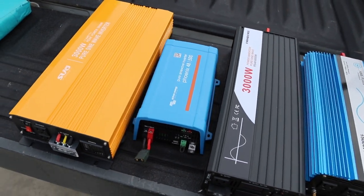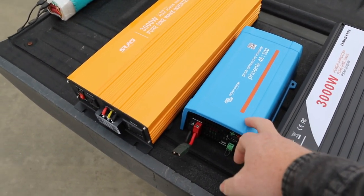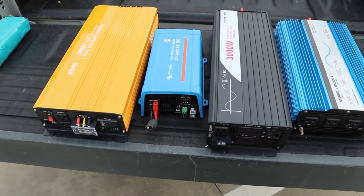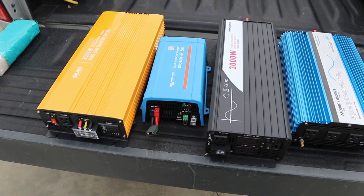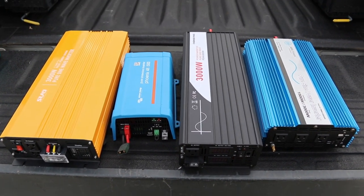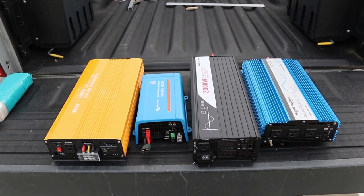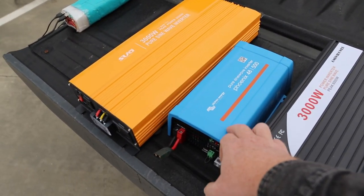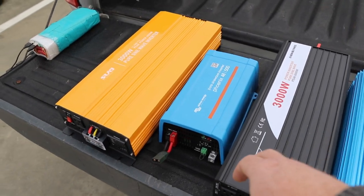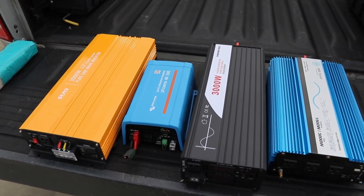About a year ago I bought this Phoenix from Victron Energy, and that's the company and inverters that I like. I'm pretty sure this is what they call a low frequency inverter, and the rest of them are high frequency inverters. You can generally tell that by how much copper is in them - they have one huge giant inductor and not much else, and they're probably a low frequency inverter. High frequency inverters have a bunch of smaller, more sophisticated bits in them. There are pros and cons to each. I bought this essentially because I have a 52 volt electric bike and batteries for it, and it'd be nice to have something to run my computer and things like that in case of a power outage.